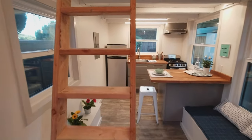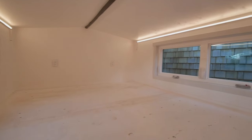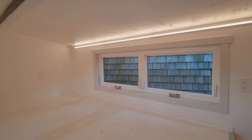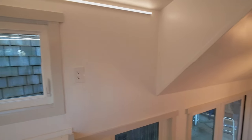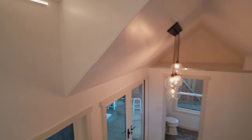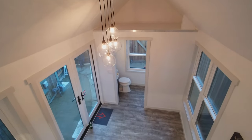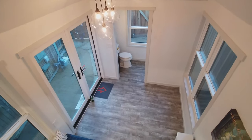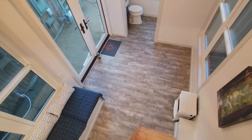Now let's climb the ladder into the master loft. The master loft is nine feet long with LED strips running on both sides of the ceiling the full length. There are two sets of unique windows in the master loft — on the right side we have awning windows and on the left side we have egress windows for emergency escape. These windows are also required for RV certification on all tiny house builds. The Rubicon has a split-style roof, with a steep gable over the living room and bathroom, and a very low sloping dormer section over the loft for increased headroom.